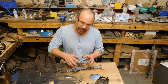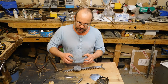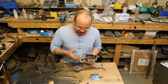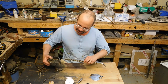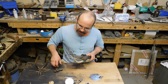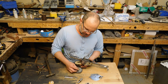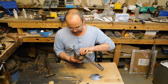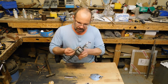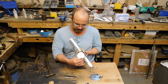It doesn't need much force, but basically if I try and pull that out — i.e. I have let go of the handle — the whole system will jam and so it won't unwind itself, which is exactly what you don't want when you're spanning a bow, as I showed you earlier. So I'll just pop it back together again now and talk you through it as we go. The first thing you do is pop the rack in, put the hook on it, and again you just pin it together. Because the item is handmade you do want to have some care about which pin goes where, because it does matter. So the main gear now — I'll put the correct spacer washer on the bottom, just turning it upside down so the washer doesn't drop. There we go, in position. The washer onto the little crank pinion — again pop it upside down and now you can see how the mechanism works. It's all functioning very well now.